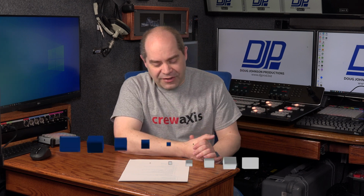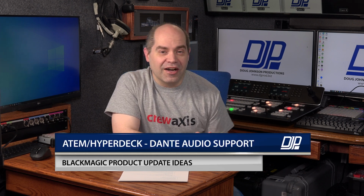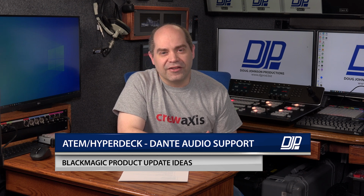All right, next one. This is kind of a pie in the sky wish, but I would love to have Dante audio support on ATEM switchers. Blackmagic has gone with MADI on their 4ME Constellation models and the new Television Studio HD8. The problem with MADI is it's point-to-point, and we really do need point-to-multi-point audio capability. So I know there are ways to convert MADI to Dante and vice versa, but that's an extra investment that needs to be made, and it's not cheap.